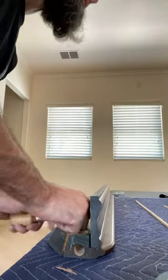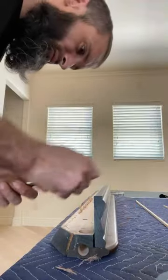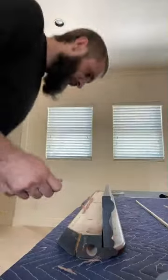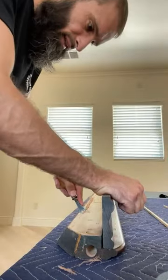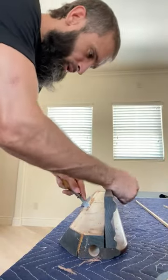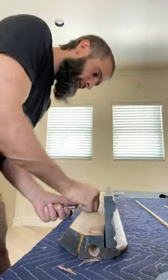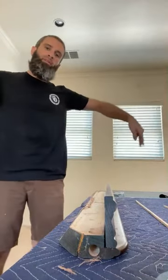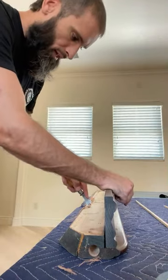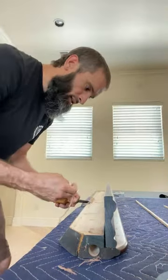And then of course, we're going to get these staples finished, and we've got three rails left, and then we'll be done, ready to start leveling the pool table. We already leveled the frame, so we already got a little bit of a head start on the leveling process. We want to make sure the frame is perfectly level underneath the legs, and we want to make sure the center slate is perfectly level long ways, so that when we start leveling underneath the slate, none of that is affecting the way the ball rolls in either direction.